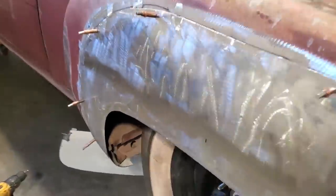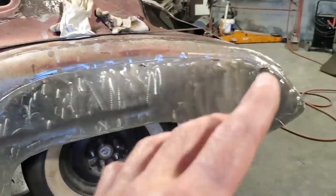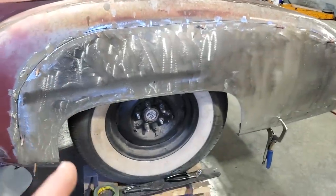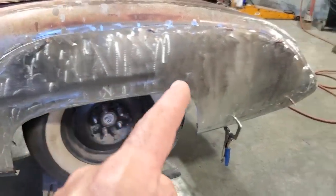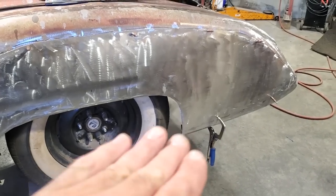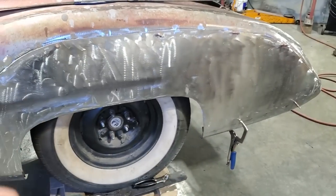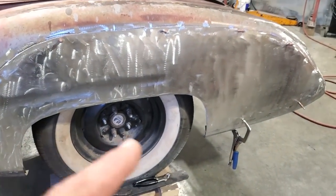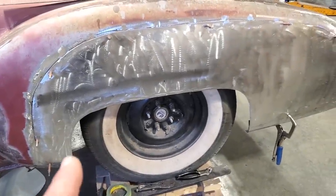And what I'm going to do here now, I've been sizing it all up. I'm going to leave this cleat going onto it. I'm not going to weld it back on yet. And I've noticed and I've figured out that from here, right around here, going right down to about here, that entire wheel lip is square, okay? It should be flat on these. So what I'm going to do, the bottom side is a bit different on the front and on the back. So I'm going to make them separate.